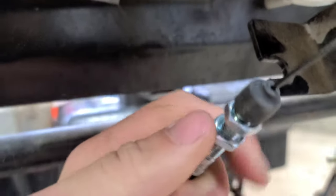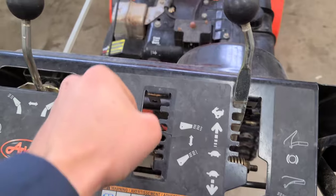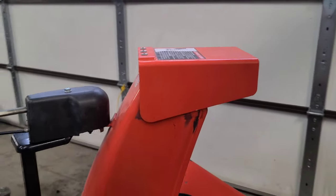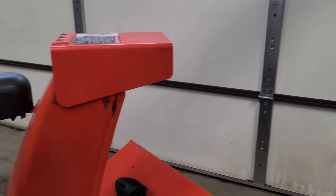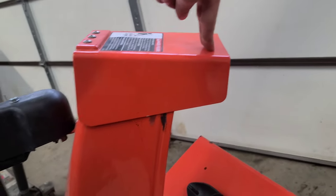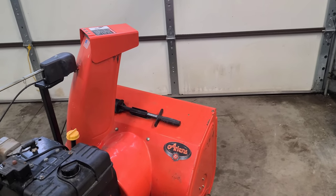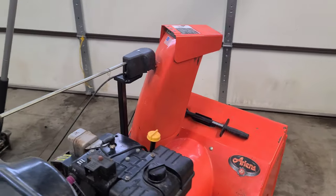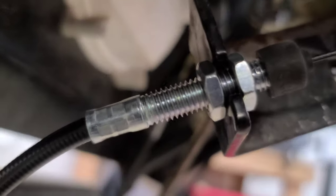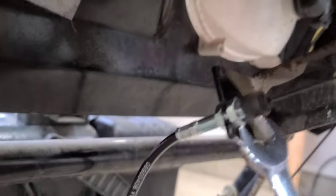Loosen up that nut, bring this cable back, and loosen up this nut here — bring it back just a little bit and then put it back into place. Now as we bring this back it goes all the way back, and if we bring it forward, as you can see it's now bottoming out and it's actually going to be shooting your snow parallel with the road. Now we can go just a little bit farther down, but I do not like to run the snow blowers like this because I find no need to bring them all the way down. I like to keep them parallel — with these bigger snow blowers you're more than likely going to be shooting some snow across the road or fence. If you do need more adjustment to bring the directional control farther down, you do have a few more threads to work with, but I find it pretty safe here just for my application. That's where we're going to hold it.